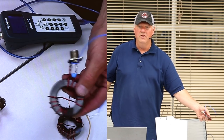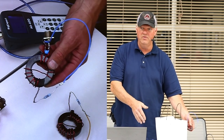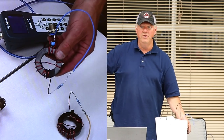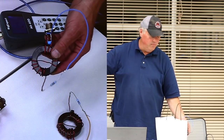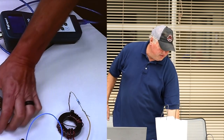The reason is type 31 has a tendency to work better on the lower frequencies, down around 160 meters, 80 meters, 40 meters. Type 43 has a tendency to let us get up higher if you're somebody that wants to work on 15 meters and 10 meters. It works in the higher frequencies. So these are transformers for the end-fed antennas.